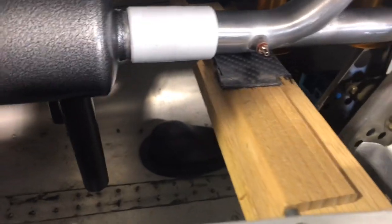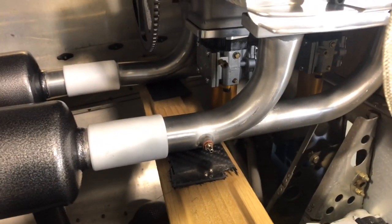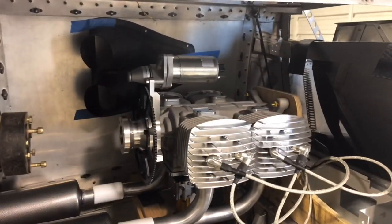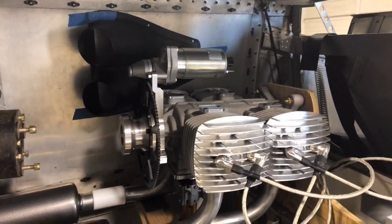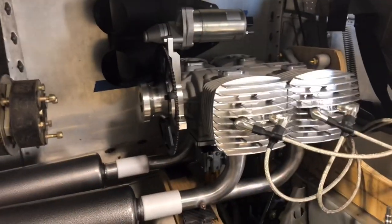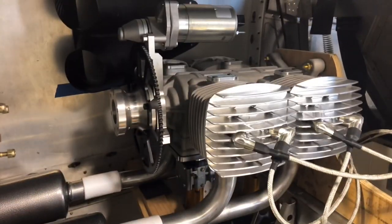I'm thinking that on the bottom of the aircraft that's going to create a slight high-pressure area, which should help keep airflow going in flight and optimize performance — cold pressurized air into the engine, and a vacuum system that creates airflow across the engine. This cooling system works in ways that haven't been proven before because no one has built it in a way that creates the pressure chamber to force air over the engine properly. Every time you stick another scoop or vent into this engine compartment, you create a path of least resistance that negates the ability to force air over the engine.